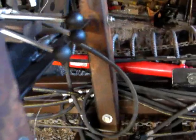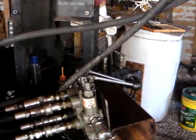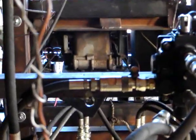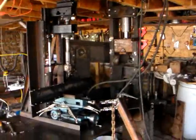The valves quick-connect: this motor spool valve and multiple valves are mounted to this plate here. The plate is quick-connect — simply undo one bolt, take all the attachments off, and you can replace the valve or take it off and use it somewhere else. There's another spool that fits on there — that's the one I've got connected up to the drill press at the moment. You can see here the nut welded on, it connects up there and to that connection, which comes out and connects directly onto the other side. It screws into the hole — it's all very modular, quick assembly and disassembly, very practical.